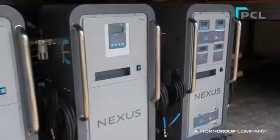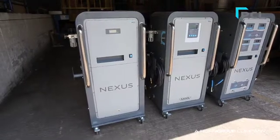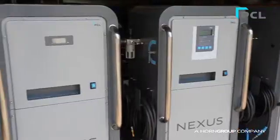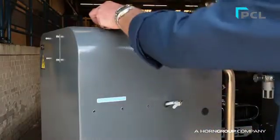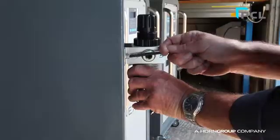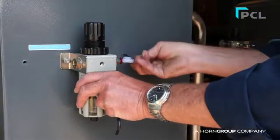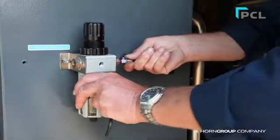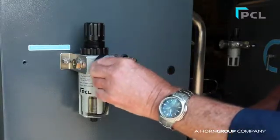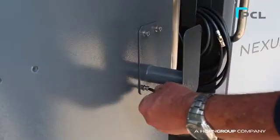Installation and setup of the units is very simple. Before operation can commence, the user must install the air filter bracket and hose hanging brackets onto the outside of the machine. This is done by holding the filtration unit with brackets attached in position on the left side of the unit and screwing the two nuts and washers into the holes next to the compressed air outlet using a 5mm Allen key. Repeat the process for the four hose hanging brackets, locating two on each side in line with the holes in the cabinet sides.